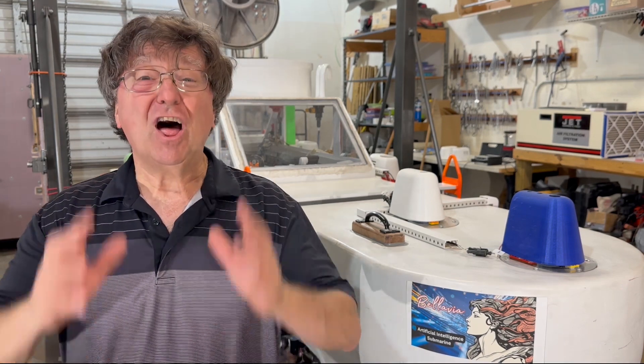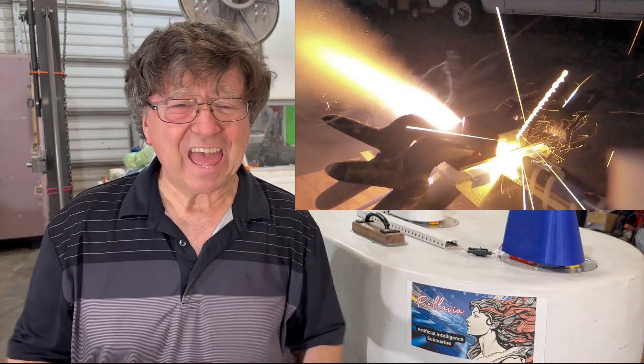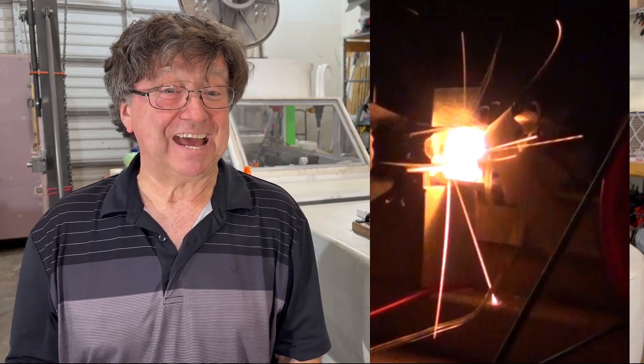This will tell us about the channel configuration and how the electrodes interact with the plasma, assuming that it actually holds together. One of the big concerns is thermal shock — it is over 2,000 degrees at the core. We've been using glass and it works, but the thermal shock tends to break off slivers that shoot out everywhere, which is a bit of a safety hazard. Machine ceramics is the normal answer, but it's pricey for the number of tests and the constant configuration changes that we do.